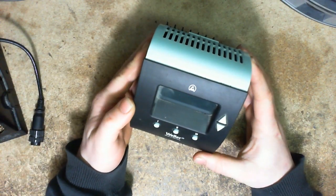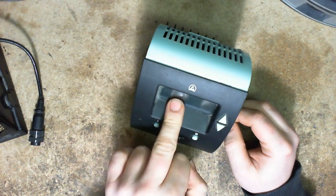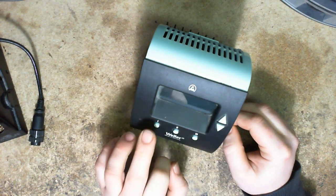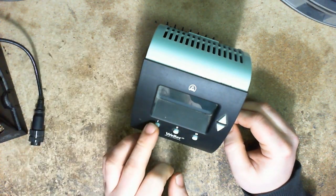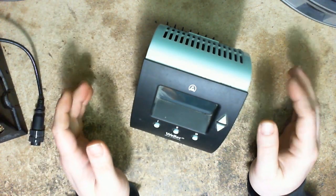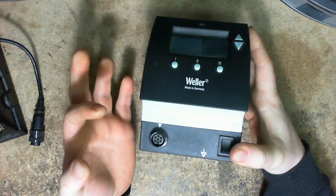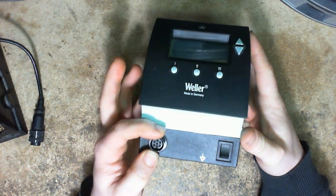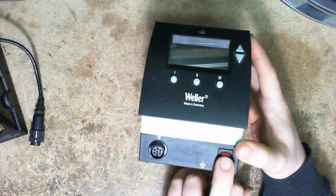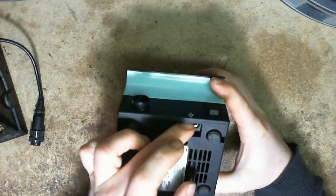This is a Weller WD1 digital soldering station. It has an LCD display for setup and temperature, an up and a down button for temperature control and menu navigation, and three buttons on the front for setting three different preset temperatures and menu navigation for configuration. There's a bunch of fancy features built into this. You have a DIN connector here for your iron or tool. There's a number of different tools available for this base station. Power switch right there. And I'm assuming this is a ground lug here for either a strap or just an additional point of grounding.